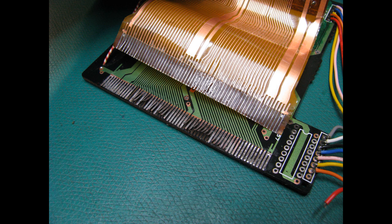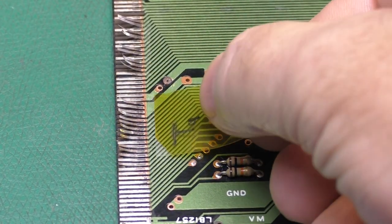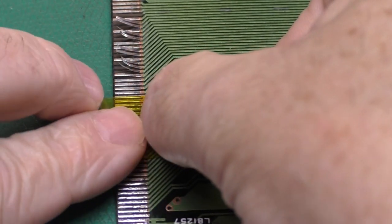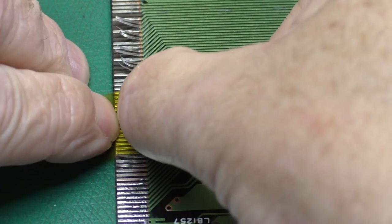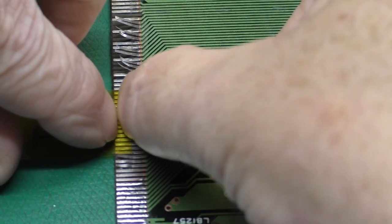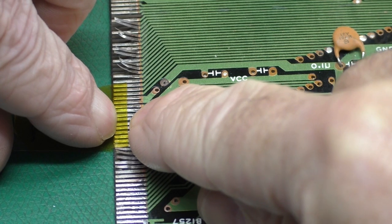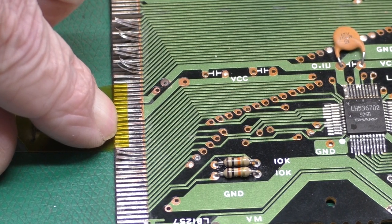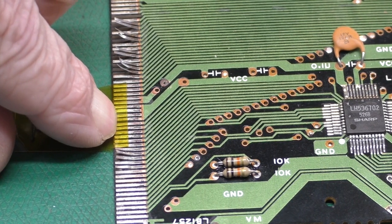The only choice I had now was to try and glue the lifted pads back down and reattach the flex. So what I'll do is put some epoxy under these lifted pads, slide this piece of plastic over to flatten them out, try to get them all straight, slide it down here to the edge, carefully holding it down, and then put some Kapton tape over the back. That is the theory — I'm not going to do this on camera, but I'll show you the taped results, and then we will look at it tomorrow evening after it's had a chance to cure.